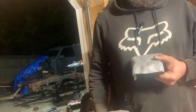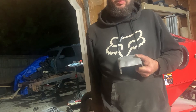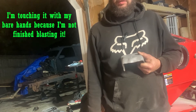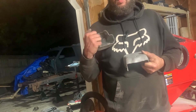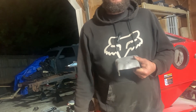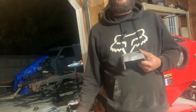My hands are very dirty right now, but typically after you sandblast an object you're not going to touch it with your bare hands — you're going to put gloves on or pick it up with a rag, because any oil will smudge on there and affect the powder coat. Any dust or grease, anything like that — personally, I wash mine off after I get done sandblasting to make sure all the sand is off, especially if it's going near an engine.